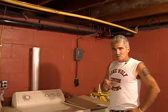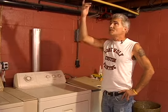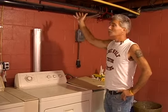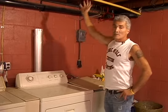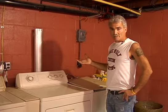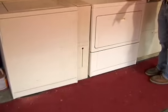If your house is 5 years old, 5 minutes old, or 50 years old, you're still going to have the same thing. People walking across the floorboards, running, stomping, kids chasing the pets, vice versa, that dirt is going to rain down onto your paint job. My suggestion, go to a lumber yard, buy yourself a sheet of Marlite, put the Marlite up, or buy some Visqueen, staple it up. This way you trap the dirt up here, you don't have dirt raining down onto your paint job.